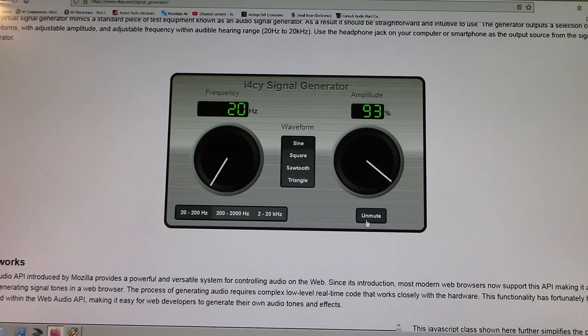We definitely have a difference between these two speakers. These speakers are making their own noises — not only are they not producing pure program material, they're adding in their own sounds. Now let's try the next range, from 200 to 2000 Hz. This will be a good test for the mid-range, and if we have any damaged voice coils, you'll hear buzzing and rattling in this range.